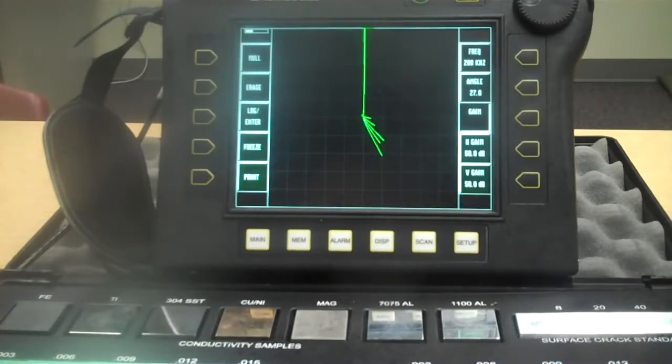Okay? So that's a conductivity curve. We could sort alloys just looking at magnetic versus non-magnetic. So if I'm just going to touch the underside of this table, which should be steel. Okay? Which it is. That's what it's telling me. So let me touch my watch. Hopefully it's not fake. Okay? That part of my watch is stainless steel. Alright, that part of my watch is pretty close to stainless steel. I must have a cheap watch. That's okay. I didn't need an expensive one anyways.